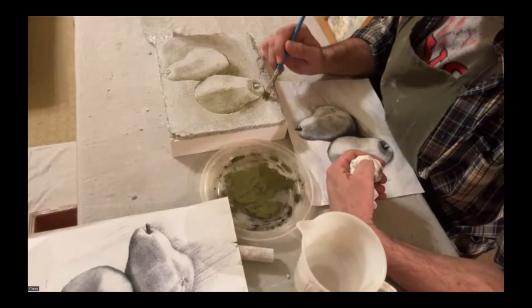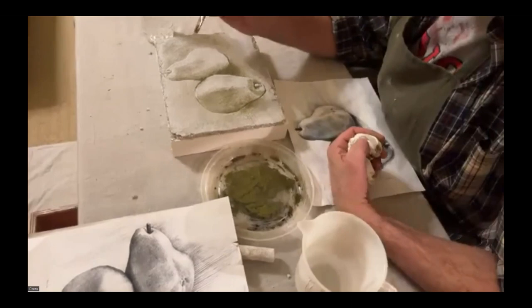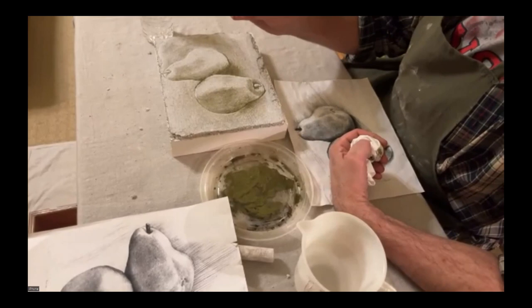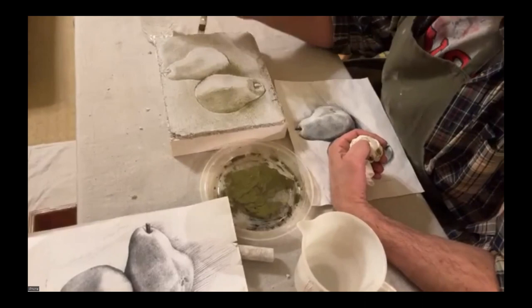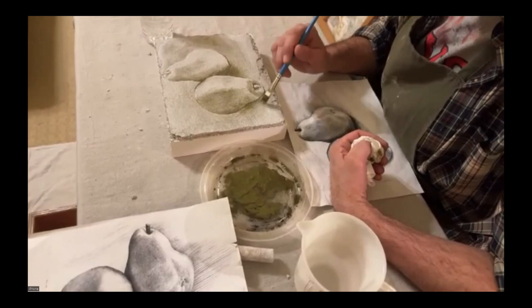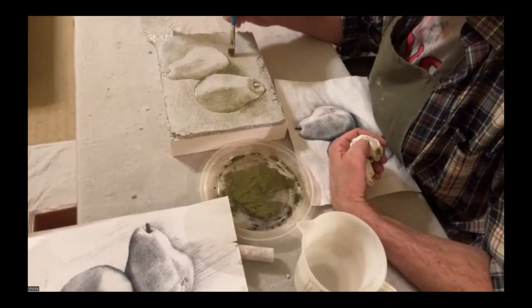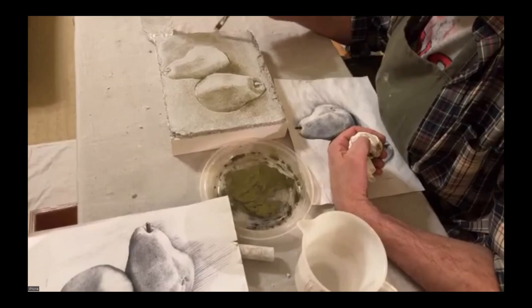But painting on dolomite-mixed plaster is so different. The consistency of the plaster is like cream cheese. You have to wet down your first coat of plaster with a little lump of cream cheese plaster. It's like when you put butter around a hot pan and it melts. That's what it does when you go over the base coat. It melts away, but it creates what's called a slip coat. That slip coat is what enables you to apply the cream cheese on top of it, and it holds. Otherwise, it peels right off when you plaster it on. So the reason for a slip coat is to create a better bond between your coats of plaster.